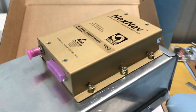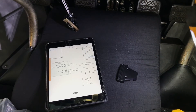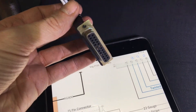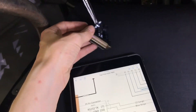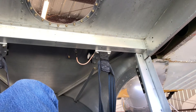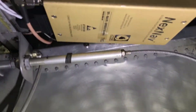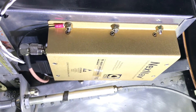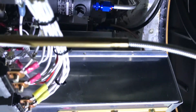I've mounted the GPS receiver to the bottom of the glove box. One of the last connections to make — I just snapped the pins in for the power for the GPS unit. I was waiting on that to make sure everything else fit so I didn't have to pull any other wires. The GPS antenna is looped up there and will eventually get a 90-degree connector. It goes through the wing root, comes out down here under the panel where it's attached to the GPS under the glove box. You can see the ground attached there as well as the 25-pin connector with the two data lines — all attached to the glove box.